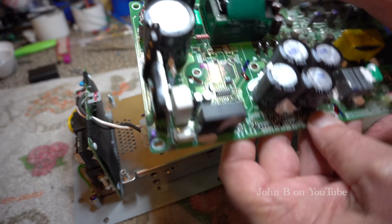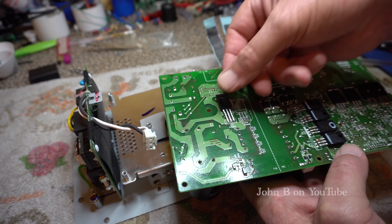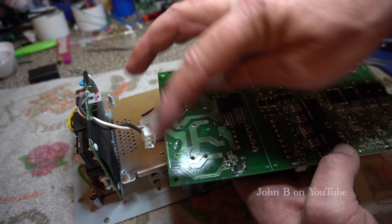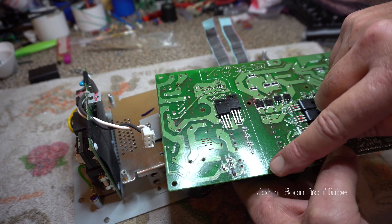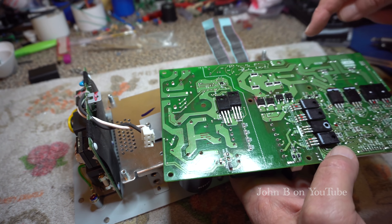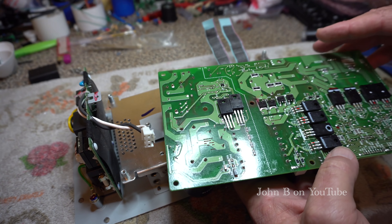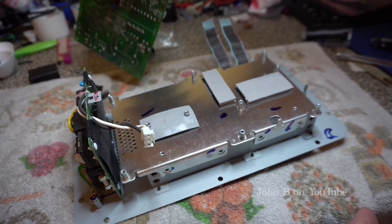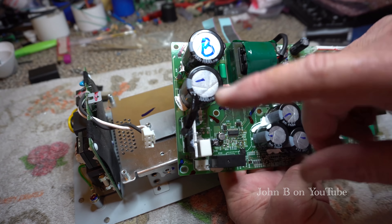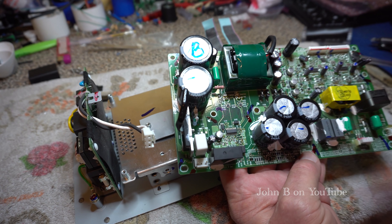So here's the board and the transistors sit underneath, but I haven't soldered them on yet. Here's two for the switch mode power supply. So that's all the switch mode power supply, and you can see that line there — presumably that means that's the hot side. This is obviously a lower voltage. So no PFC circuit, which makes this more reliable than the Mackie straight away.